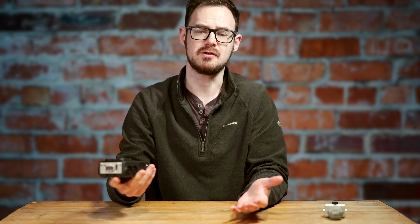I normally have it set up at 48 kilohertz, 24-bit in WAV, because why not? I want the best quality. And even though I'm outputting 16-bit, I like to have the dynamic range to play with.